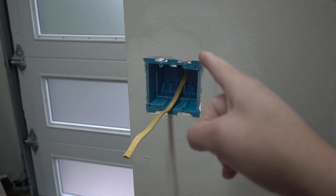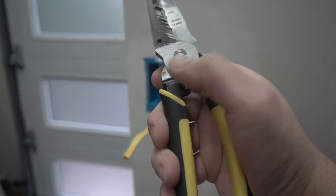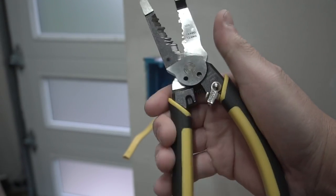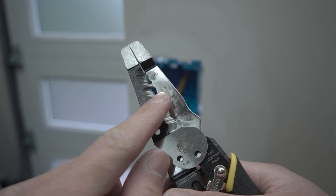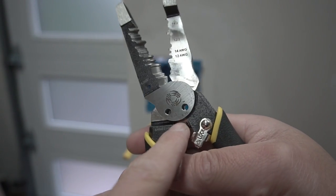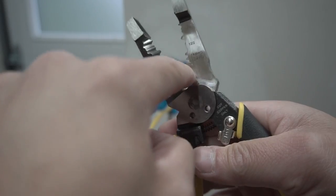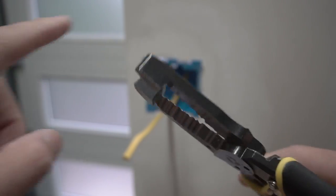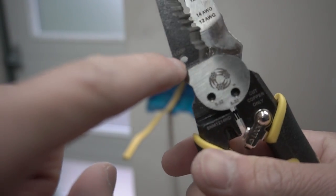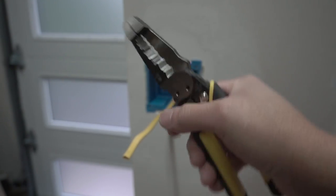Method number three is one of my favorite methods for stripping wire and it's super easy if you have it — it's by using this cable stripper. This one is by Southwire and it has a lock mechanism. Once you unlock it, it is loaded with a spring on the handle which makes it super easy and ergonomically easy to use. You can strip two types of cable — 14 gauge and 12 gauge — and it also has a wire stripper for 14 and 12 gauge, plus little cutters where you can insert the wires and cut easily. If you're interested in this product, I'll leave it in the description down below.